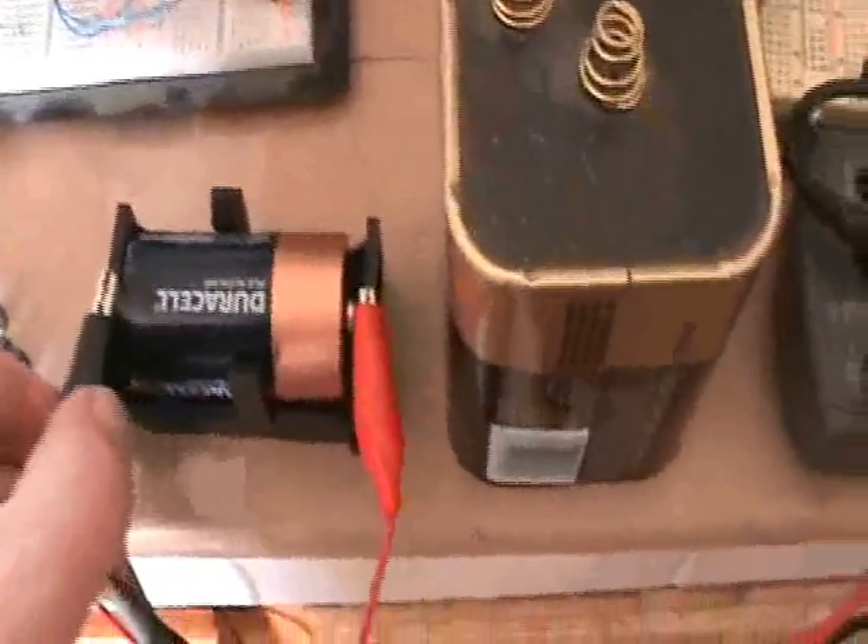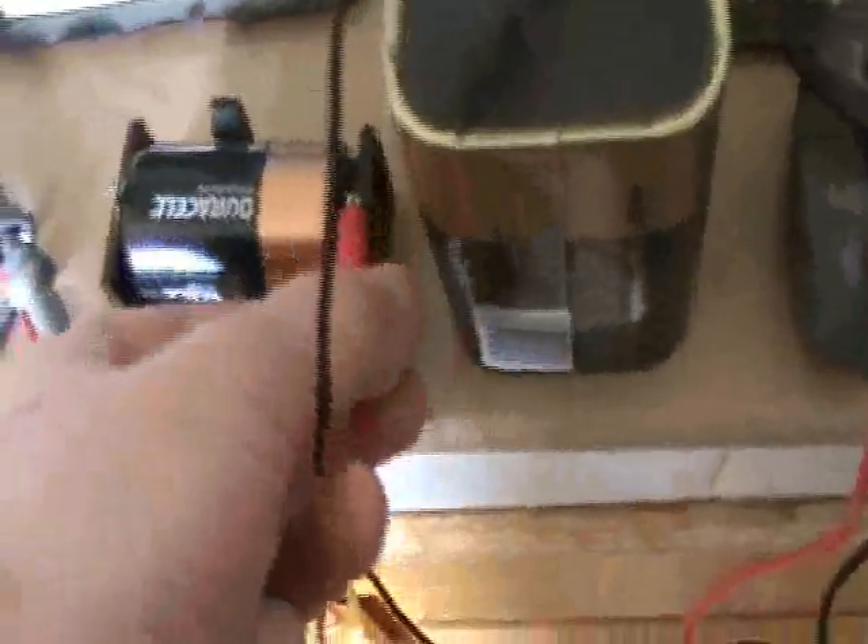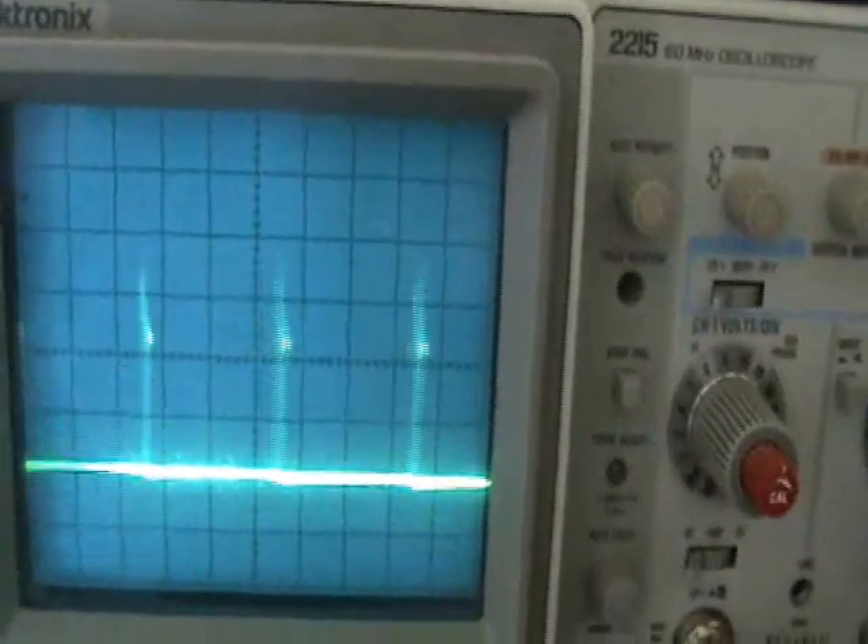This is a challenge for using an oscilloscope because the notion of triggering is very difficult with all this jitter. One thing I can do is switch to a six-volt power supply. These transistors can handle that, but they do start to get warm — even with the 1.5-volt battery they got warm. With more power, the buffeting is much more intense, which points to the idea that by creating a more intense magnetic field pulsing regularly, it becomes more sensitive to the buffeting pressure.